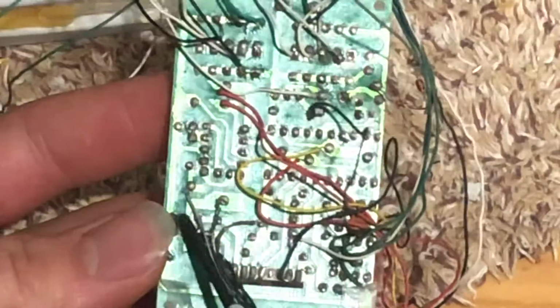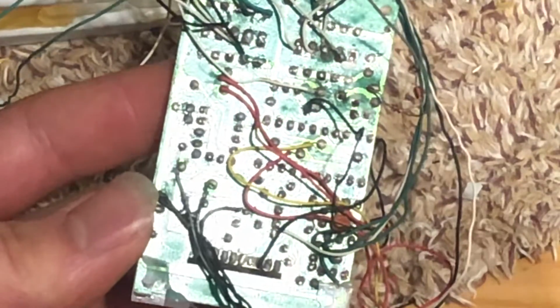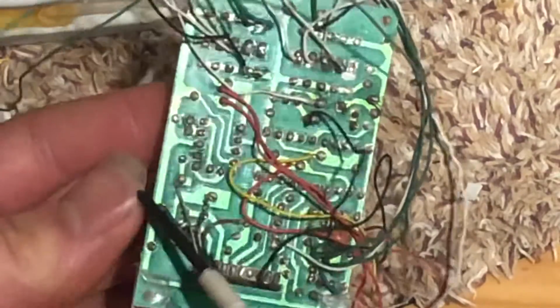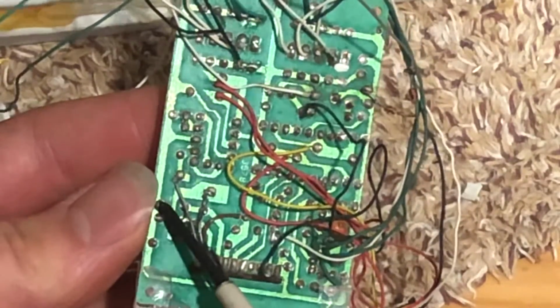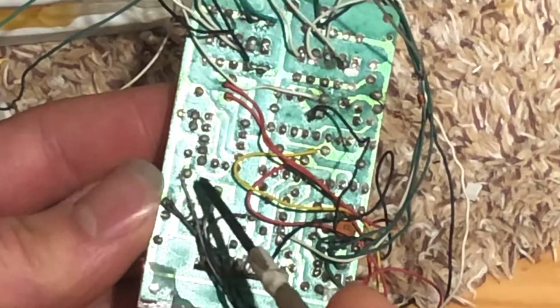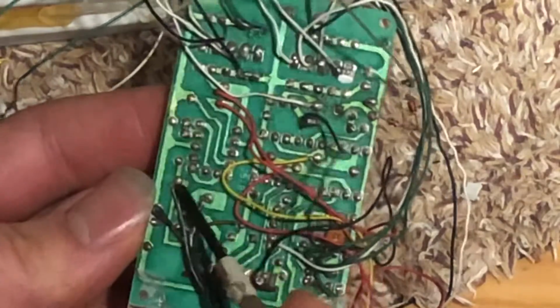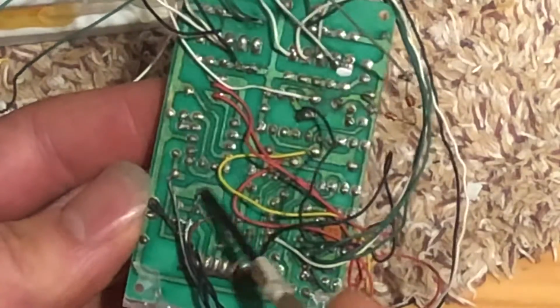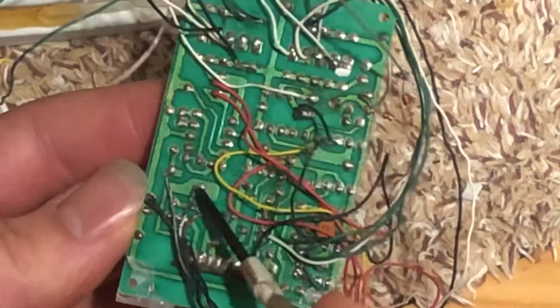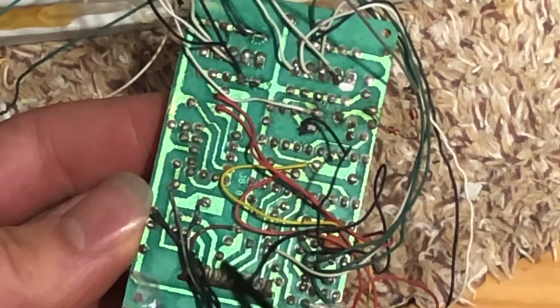Yeah, so here there's 2 connected to this pole, and this is factory done. One of them is a grounding wire for the main computer board. This joint runs basically the whole length of the board, and it's the negative side of the circuit. And then the other wire goes to the potentiometer inside of here to ground the speaker so you don't have extra buzzing. And then the other 2, this one is for sure for the speaker. This one, I'm not 100% sure. I think it's also speaker though. And then this one's the power. So this is the positive wire that is for the whole circuit board.